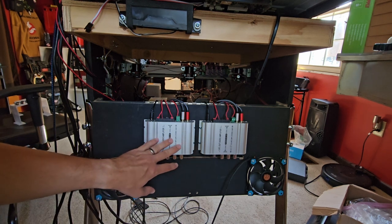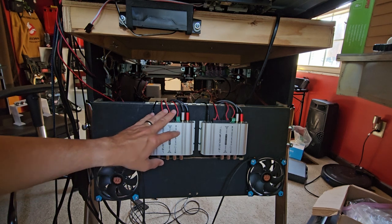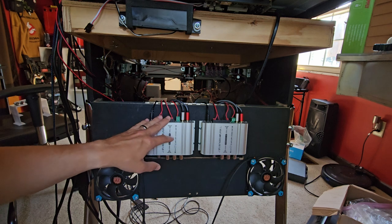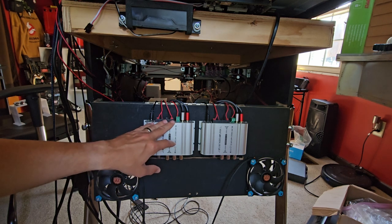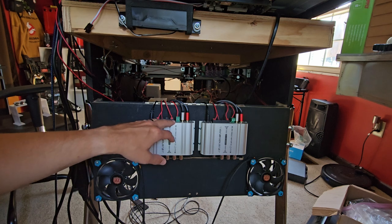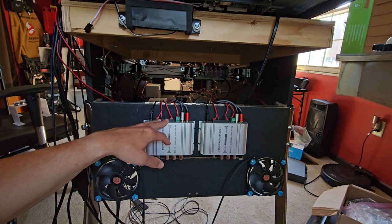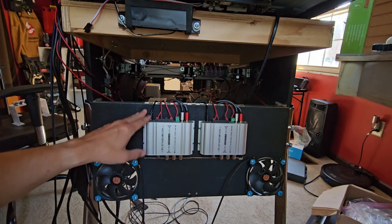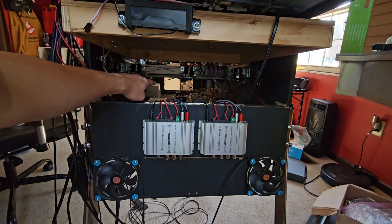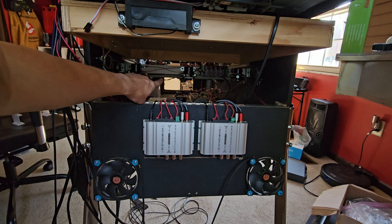I've come to realize I need to have these a little bit closer, because we have the issue with the subwoofer vibrating the accelerometer, and almost every table needs to be adjusted up or down in pinball. There needs to be a little bit of tweaking so I can get each table adjusted appropriately. And as I add more tables, this will happen even more. So I think it's time these get moved to a closer position, up near the coin door.